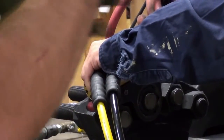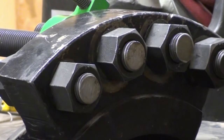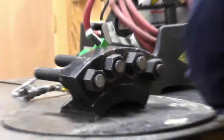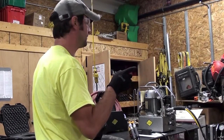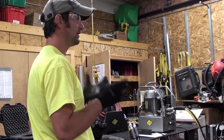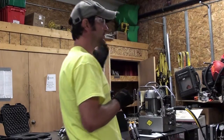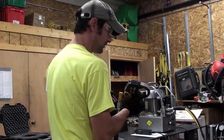I even have to look at these all the time — if I'm going backwards or going forward. A lot of times you can take the links and actually ratchet to see which way it's going. So I know if I'm holding it this way it's torquing, and if I'm going this way it's detorquing. Before you put it up on the nut, just make sure you've got it spinning the right way. When you're two passes into a flange and all of a sudden you start detorquing everything, it messes up the torque — you really should redo a flange if that happens. So just give it a quick whirl and you'll be able to see which way it's going.